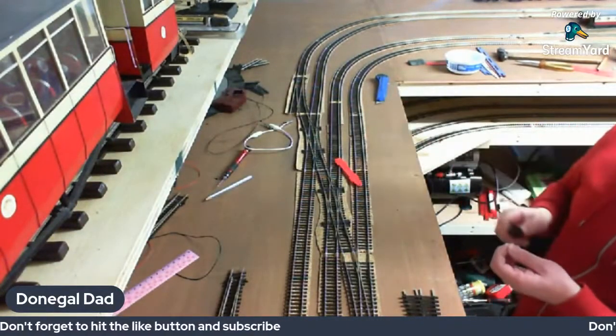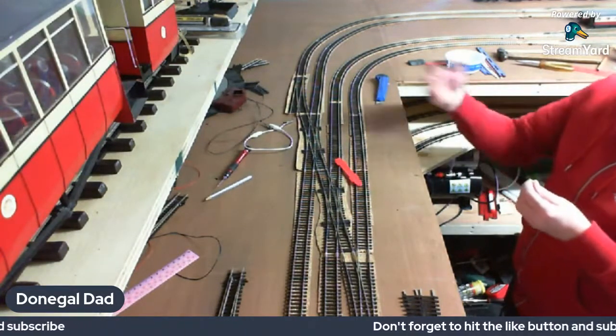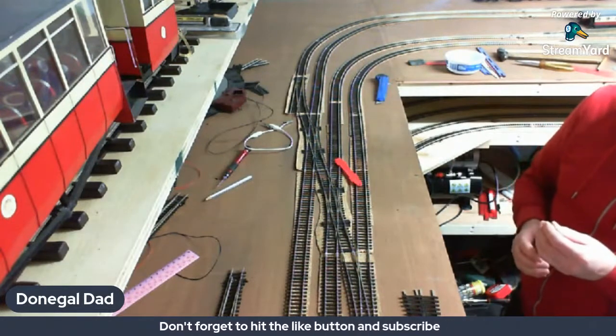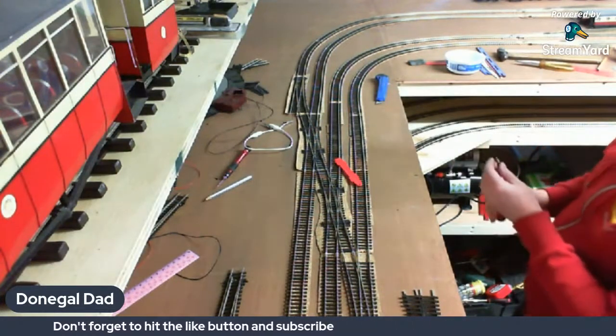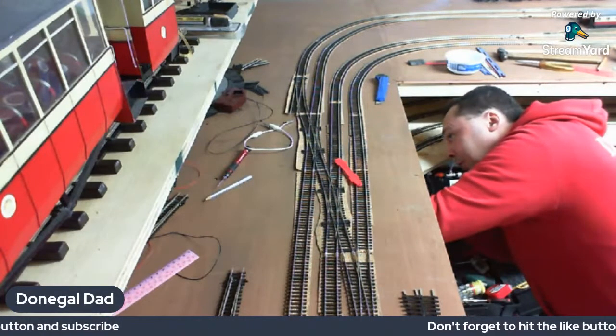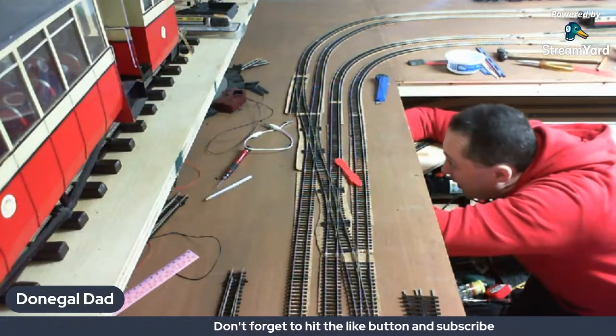But doing it this way, it makes the holes ready for the screws. So when you're assembling and putting it back together, the screw holes are already there. You just screw it in, and you know it's in the right position. So you just have to make sure the orientation of the actual switch is correct so it throws correctly.